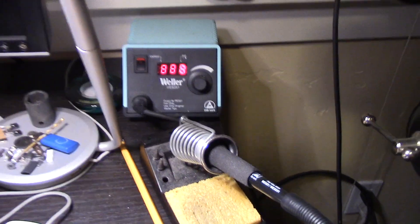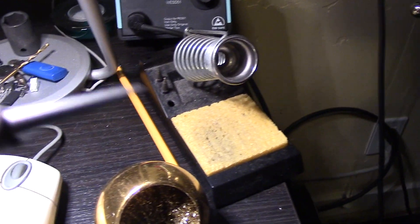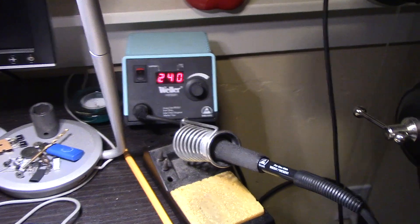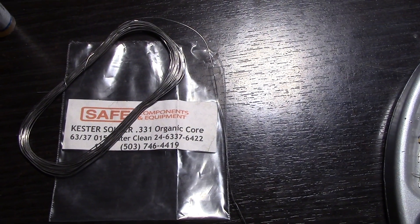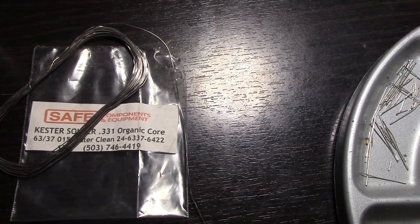The other tools I'm using for this is a soldering iron. I have it set to 630 degrees. The tip I'm using for surface mount is usually a very sharp conical 1/64th of an inch tip — it's very, very fine. I also use this solder that I got off eBay specifically for surface mount. It's 0.015 inch water clean, which is kind of nice.